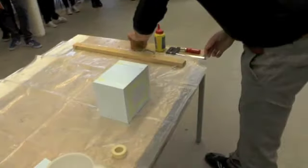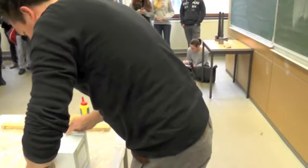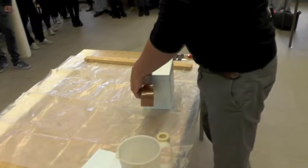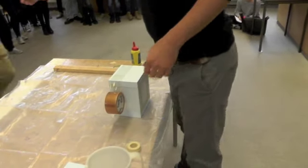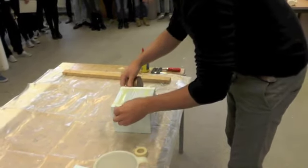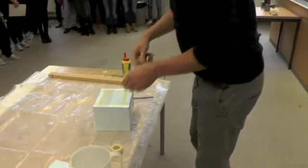Now I'll put them together on top. I always use a kind of tape like this — it's something you use to package boxes. I just put it around the mold and make it very tight, so that you're sure all the plaster stays inside and the mold doesn't collapse. I do that like two or three times. You can also use this to just finish it a bit more. How big the model is determines how strong the plaster pressure will be pushing outward.